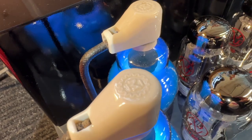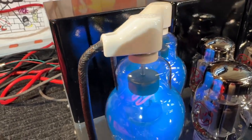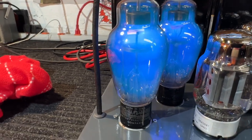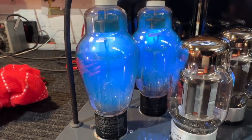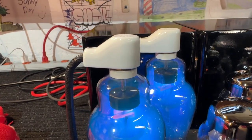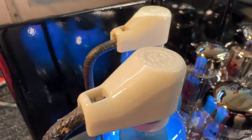This is not a tube you want to break. Under these top caps there's also high voltage — you really have to be careful. There's the 3B28, which is a xenon-fill tube; it is a direct replacement and it is safer. There's also the 836, which is a traditional vacuum tube, but it has a huge voltage sag and will not perform as well — though it is a beautiful tube that really needs a little more recognition.